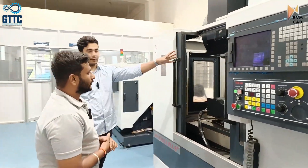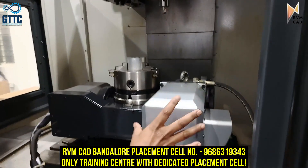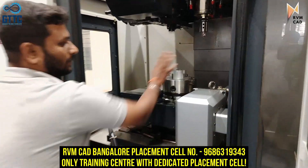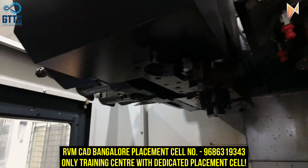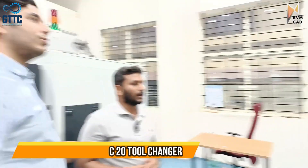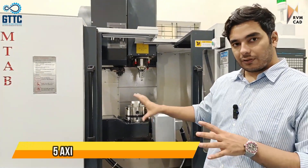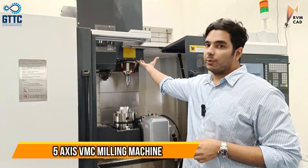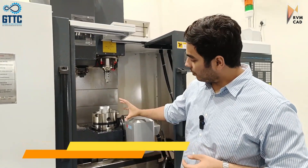This is the spindle, and this is an attachment. A basic CNC milling machine comes with 3-axis, and this is a plus 2-axis attachment we have here — we can clamp circular parts over here. This is the automatic tool changer; we can clamp almost 20 tools, so we can operate with 20 different tools. We will also show you the movements of X, Y, Z and also the 4th and 5th axis, both in CNC turning and VMC milling, which is 5-axis. The machine moves in 3 axes, but this extra rotation arm is an attachment — a very expensive attachment — and we will show the rotation of this also.